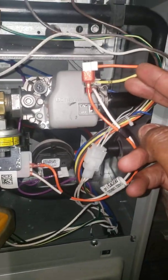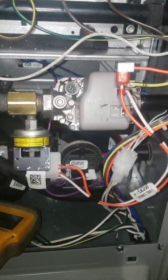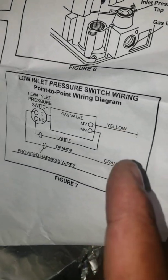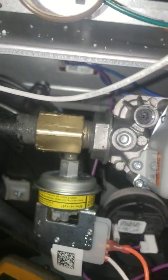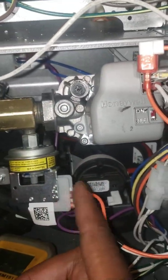The low gas pressure switch has to be wired directly with the gas valve. That doesn't mean the two wires going to the gas valve go straight to the propane switch — you still need 24 volts at the gas valve. On the schematic, out of your two wires going to the gas valve, one goes straight to the gas valve and they give you a harness connection for the low gas pressure switch. One of the harness connections is a male connector, while the two wires going to the gas valve are female.